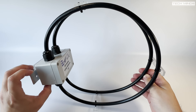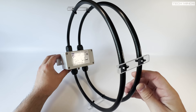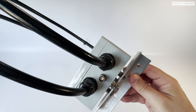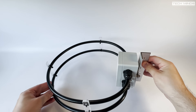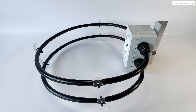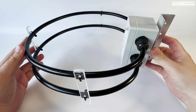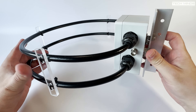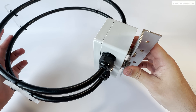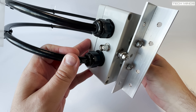This antenna is a true magnetic loop, as careful design has isolated the antenna loops from the built-in amplifier, which minimizes electrical field pickup. This also helps minimize noise even when used indoors. The amplifier also contains a common mode choke, meaning any RF noise traveling on the coax is attenuated, helping to give the user a noise-free experience. The aluminium bracket allows the antenna to be mounted either vertically or horizontally, each giving different benefits. Horizontal mounting makes it easy to attach to something like a balcony railing for those living in apartments or high-rise blocks.